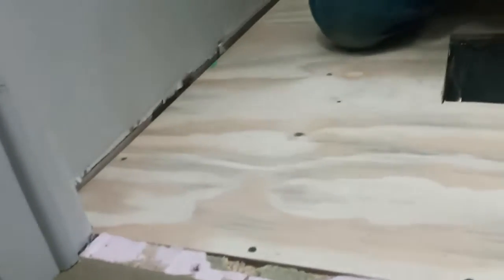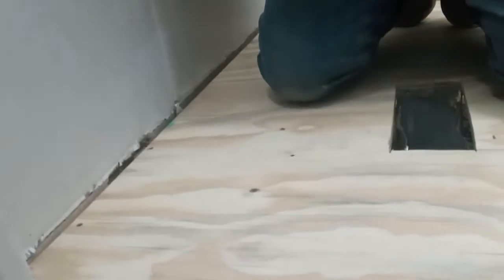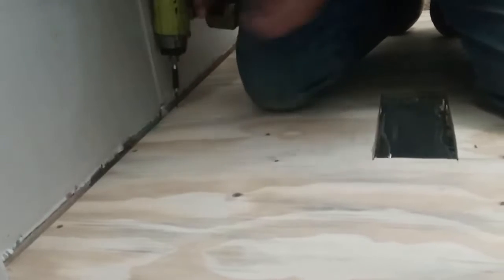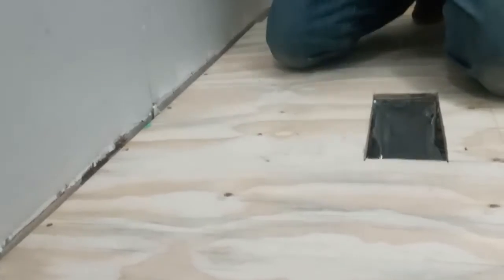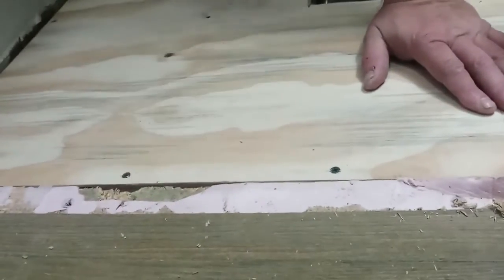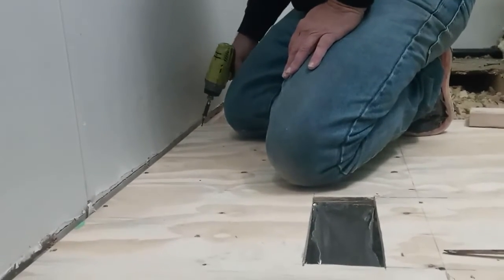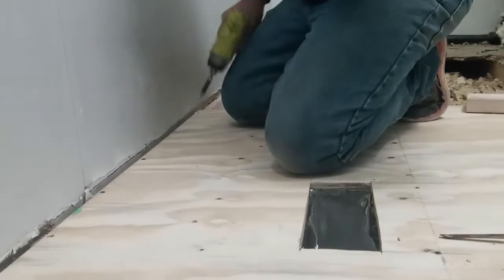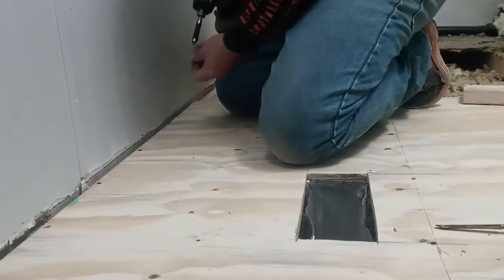You got a board here on the edge. It's like that wood was pretty swelled up. It might have been 1 inch, about that right here. If you notice, it's right on here. We were tied up against the bottom of that, so I know that that probably got swelled out. We'll fill that in with spray foam or caulking. That way no air gets in there.